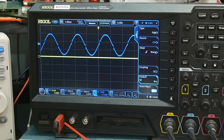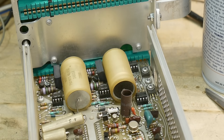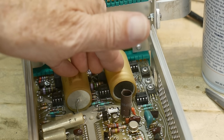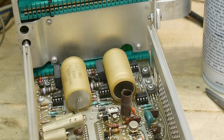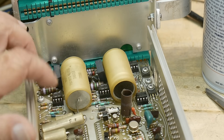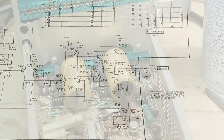We'll have to find some schematics and dig into this thing. I took a look at these big caps here - they look like they should be changed, but these are just rectification capacitors and the voltage is fine, they're rectifying and filtering just fine, so I'm going to leave them alone for now. The other ones seem to be high quality sealed tantalums and those are not likely to go bad, so these guys seem to be good so far.